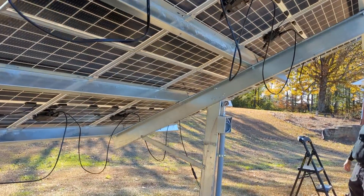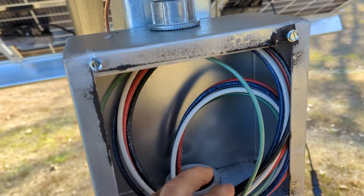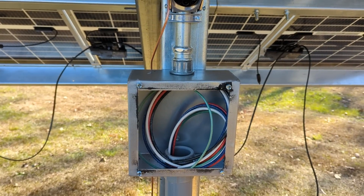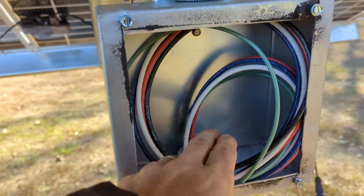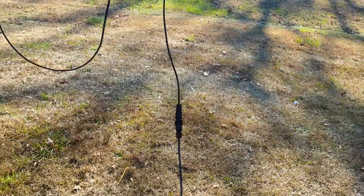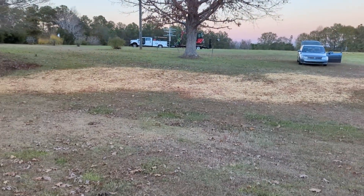We'll do some wire management — we promise we will not leave these hanging. We're making male and female MC4 connections from the end of the Q cable to our raw cable so we can bring that flat cable into our weather head, then junction up with our number eight wire going to the house. You do not need a disconnect because when the grid goes down it's automatically disconnected. You can turn the breaker off inside — several ways to shut it down. We still have to ground the system, add a ground bar, and we've got a ground rod in the ground. Then we should be able to fire this thing up today.